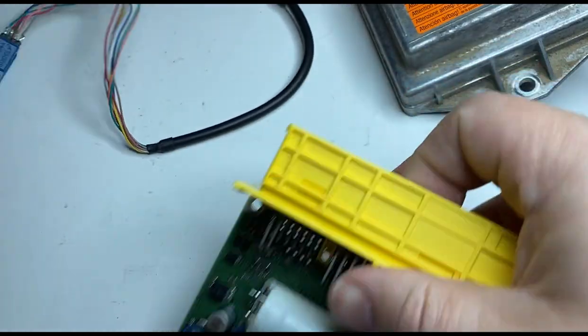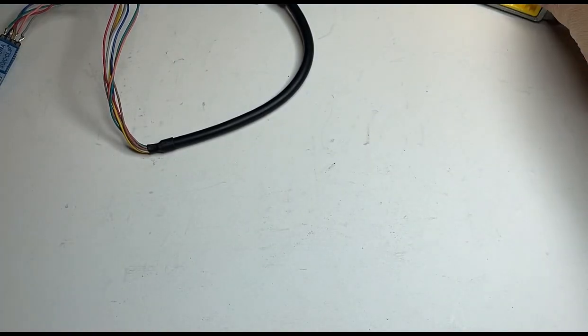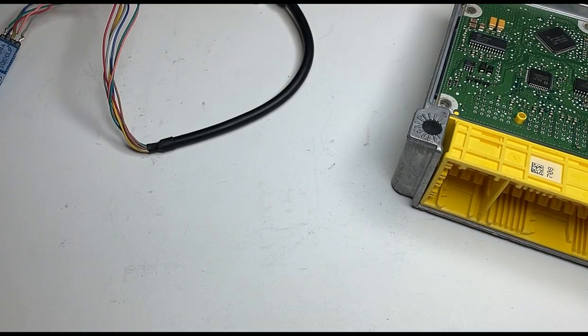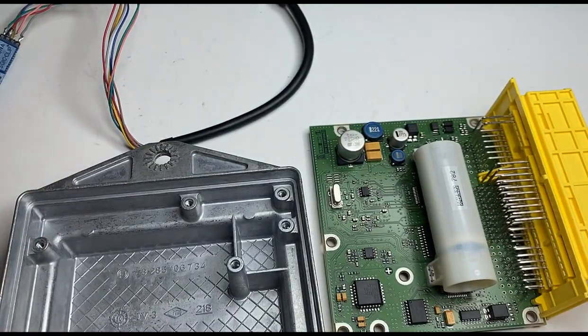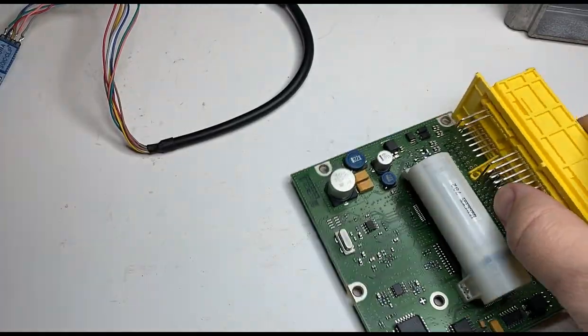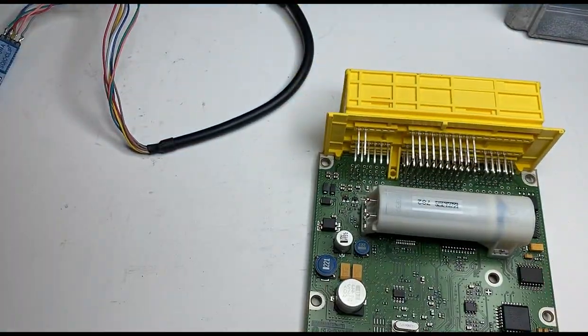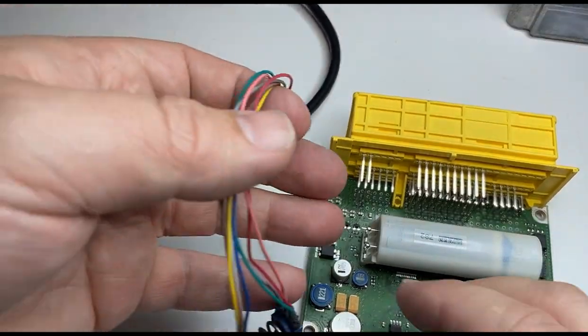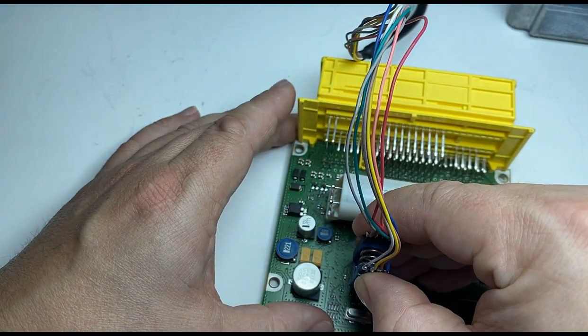All right, let's get this one out of the way. Now, for this service, or if you need to clone it, a lot of these Volkswagen, not just Mercedes, Volkswagen and Audi, some Fords, Lincoln, and some other cars, if you get one from a junkyard, it won't work. It will not reset until you have it coded to your vehicle. Heck, even a Honda that has the seat program right in the airbag control module won't clear until you either program it on the car or actually transfer to a clone.